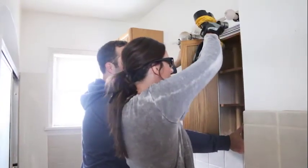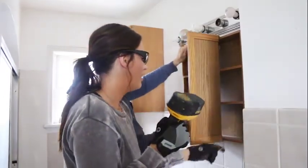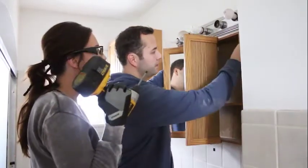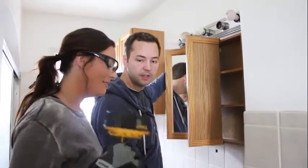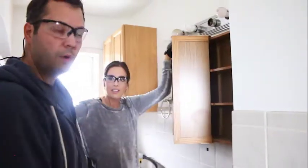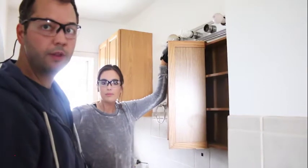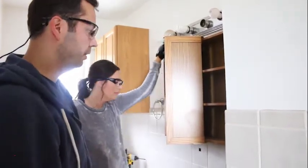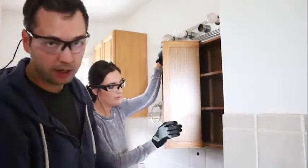Moment of truth - let's pull it off and see if it comes. It's still tiled in. Just get a hammer and we'll tap this loose a little bit. If you don't want to remove the tile, you can get a razor blade knife with a carbide blade and just score it - work out all the grout around there. Then you'll have to replace that, but we're taking all this tile out so we're not going to be as careful.